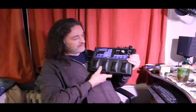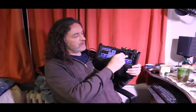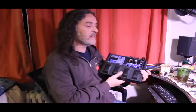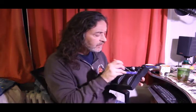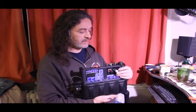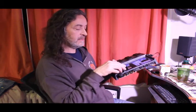Flash forward to the end of the day, and here it is. We've got the Behringer input unit USB interface here with its controls. There is a mic line here, and if you wanted to activate 48 volts, you can get at it through this little slot — take a screwdriver and you can turn on and off the 48-volt phantom power. So we can run both the guitar and some vocals or another line through here. We've got a guitar input, and basically all the inputs for the USB interface here, with the input gain and output volume controls.